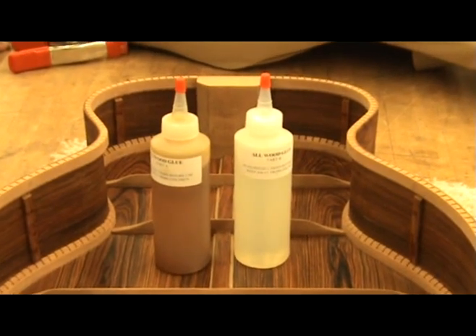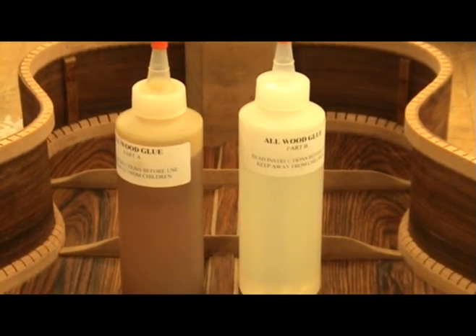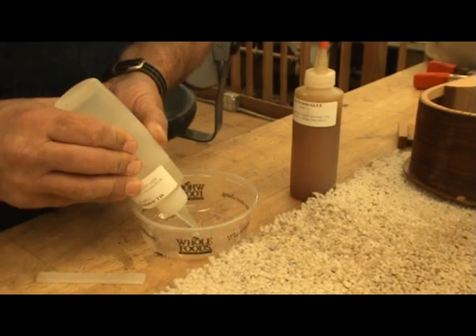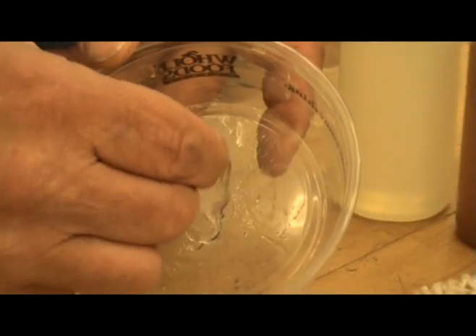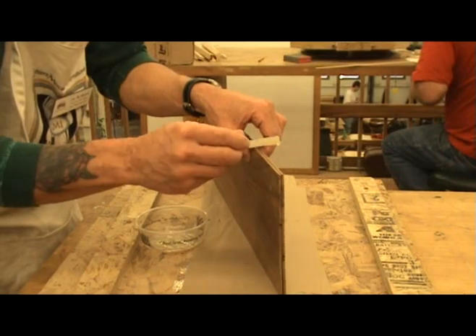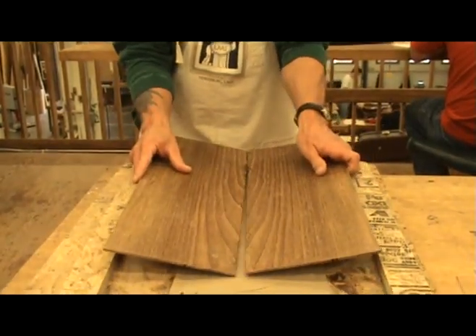Speaking of oily exotics, epoxy is the glue of choice when working with woods like cocobolo or teak that have a high oil content. Some builders wipe the oily wood with acetone to remove the oil before gluing and then use regular wood glue or LMI Instrument Maker's Glue. However, all it would take is one joint failure to make you wish you had used a glue specifically formulated for oily woods. To use this glue, put one part resin and one part hardener in equal amounts in a container, then mix the two together thoroughly. Let it sit for a few minutes, then apply it to the pieces you want to glue together. A little bit of this stuff goes a long way, so mix in small amounts and apply it sparingly. This glue can be used everywhere you need to glue oily woods together or where you need to glue things like kerfing and end blocks to oily woods, giving you peace of mind that the joint won't fail due to the oil content.